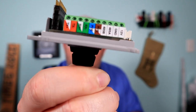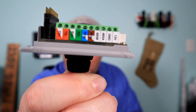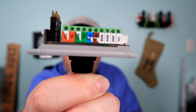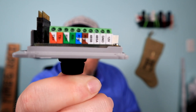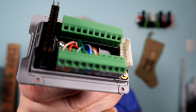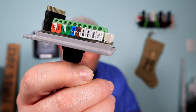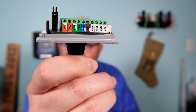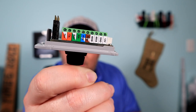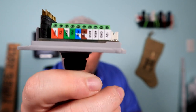When you wire this up, that Ethernet diagram on the side there may look a little weird. What you do is on the blue and the brown, you actually put those wires — you twist those two wires together and they go in that connection together. You can see how I've got that wired up. When we wire these up, we usually create these little tails and send them out with the device, so all they have to do is plug it in and make sure that it works. Their wiring person can do whatever they want. You just follow the color diagram.